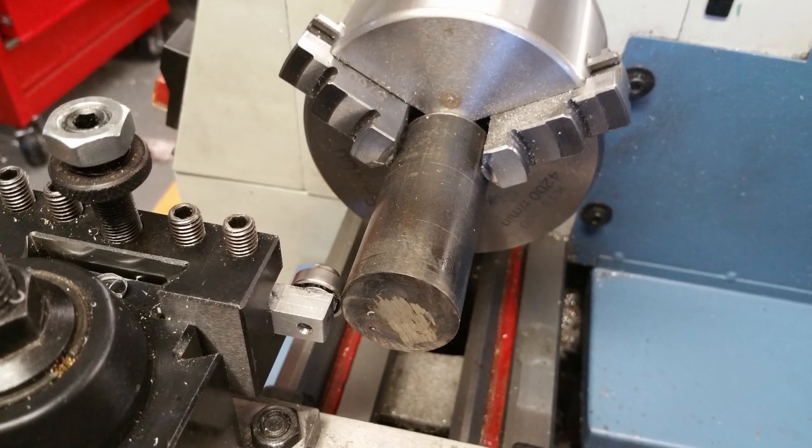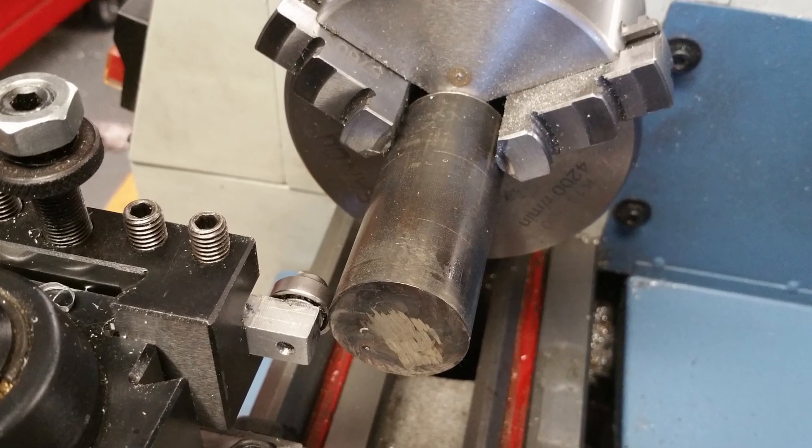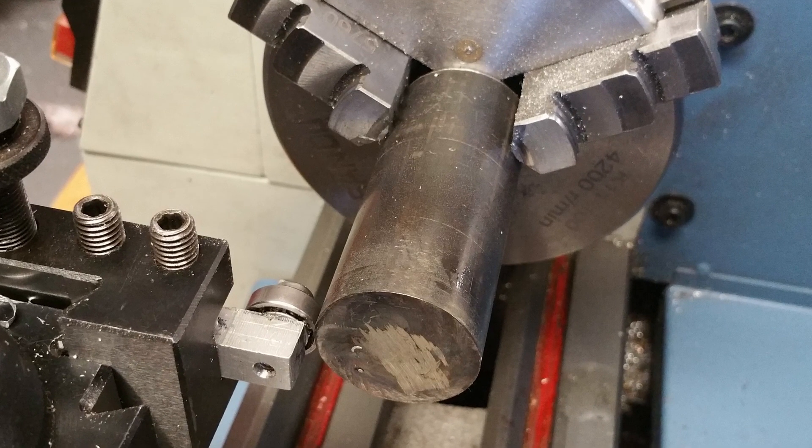What I thought I'd do today is jump right onto the lathe and do the initial rough machining, then take a small break, look at the print, and do the finished machining on the outside and on the bore. We're getting pretty good now at machining accurate bores in our workpiece. We're going to follow the same techniques that we've used before. We start by using the ball bearing in our tool holder to center the workpiece as best we can.